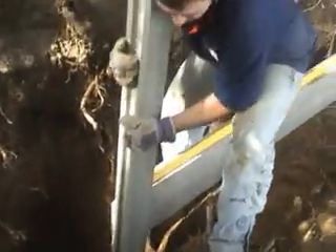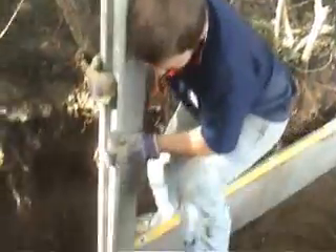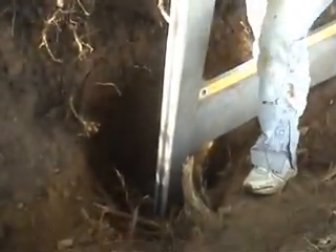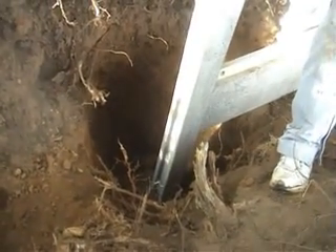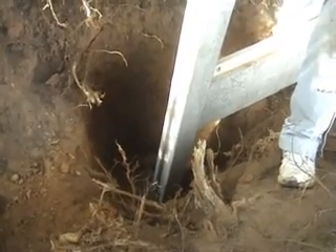Sam's got a post. We've completed the hole, put the gravel board in, and are just lowering it into the hole. We've just got to prop it up now, jack it up to the height that we want and get it level, then concrete round it. I had to dig a big hole around there because I couldn't get in with a digger at the right angle, but that'll be well and truly solid with the concrete.